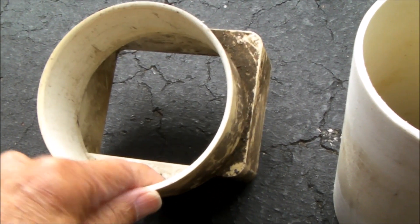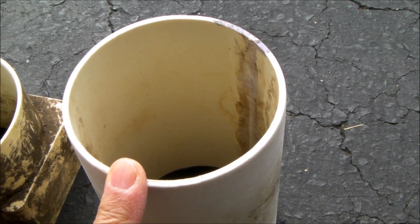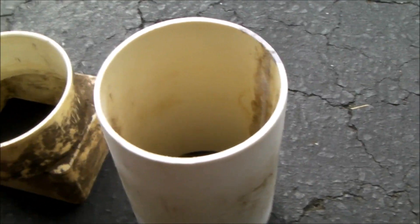There's probably a little bit of a taper in here, which is going to make this even tighter when I try to push it in. I'll just tap it in with a mallet and put a little lubricant on the side of it. My suggestion is go a little smaller in diameter than you think you really need, especially if this is not a pressure line.